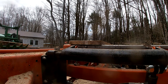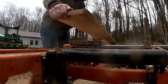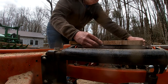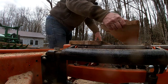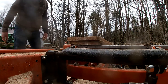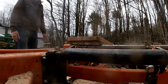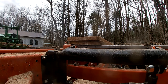Here's the second-to-last board I just got done milling. That's the whole idea behind the quarter scale — your last cut is your last cut. You don't have to take a veneer cut, shim cut, or whatever you want to call it. Basically, your last cut creates your last board. That's how we do the quarter scale.